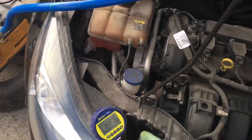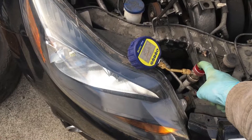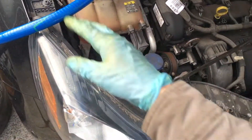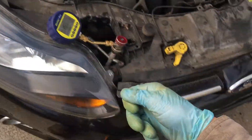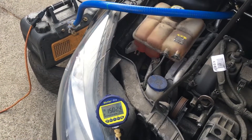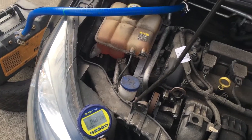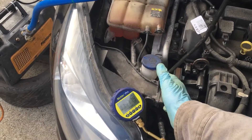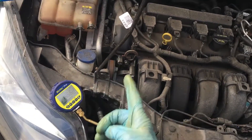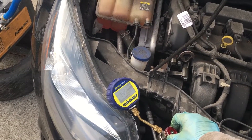I just wanted to show you the single-hose system. I'll do a second video putting the charge directly into the high side. This is only if you don't have gauges and only have a vacuum pump and maybe two hoses — or you could switch one hose between ports if you only own one. But one thing I have to say for guys who really want to learn and do a good job: a micron gauge is a must, it's not even an option, it never has been. I've been using a micron gauge since I was 12 years old.